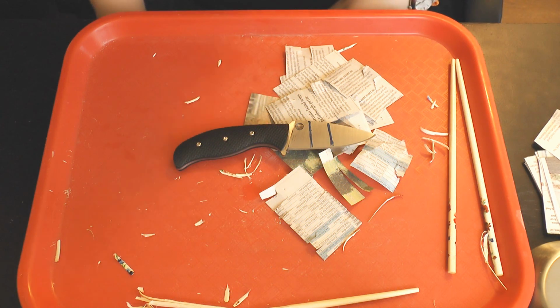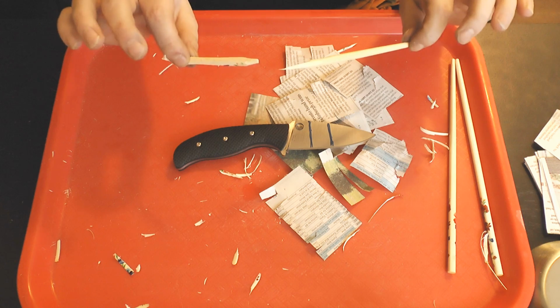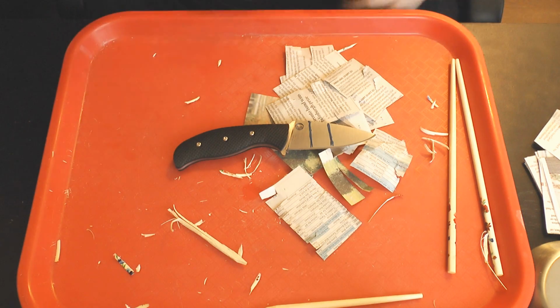As you'll be able to see from the microscope images I've included, the damage to the apex microscopically is pretty severe. There's microchips throughout the test area, and so you can see that that explains why there was such a noticeable loss in push cutting sharpness from one chopstick. Did that much damage to the apex.